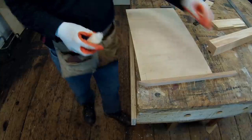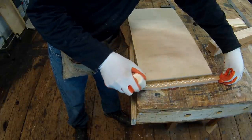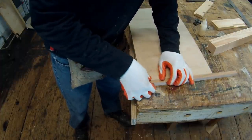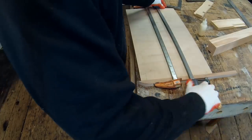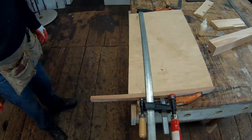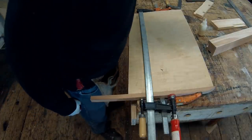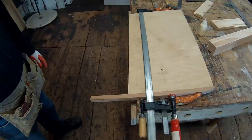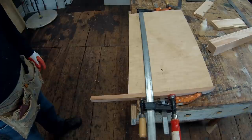The reason for making this profile oversized is to give an extra starting point for the router. If I stopped it right at a sharp corner, the router bit bearing would start to wear that corner a little bit over time and eventually take off too much material. By making that arc a little bit oversized, it results in a cleaner cut. Now I have it glued on — I'll let that set for about 30 minutes. That's the hard part: making that arc and lining it up properly.